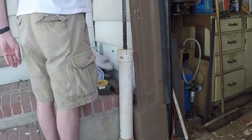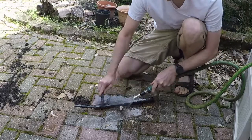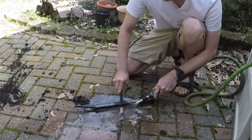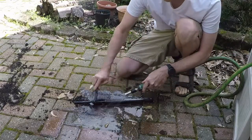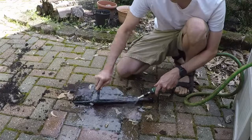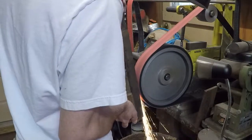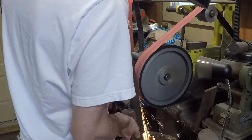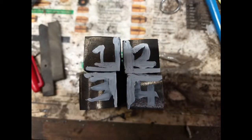It's the next day. This has been soaking in vinegar overnight, which helps dissolve all the crud and scale off the outside of the bar. I use a little stainless steel brush and a garden hose to clean off all the loose crud. This is pretty important — forge scale is very hard and will absolutely destroy your abrasive belt. You can take a brand new high-dollar ceramic belt and touch a bar covered in forge scale to it and completely destroy that belt in about 30 seconds. Here I'm cleaning up the whole bar before I cut it up into quadrants, making sure there are no flaws and that the mating surfaces are cleaned well. You can also see the markings I used to make sure I get the bars aligned correctly.